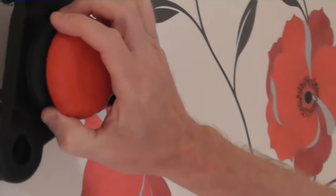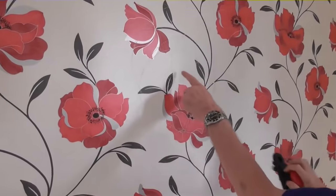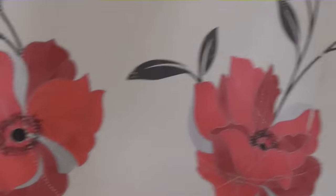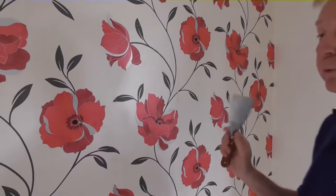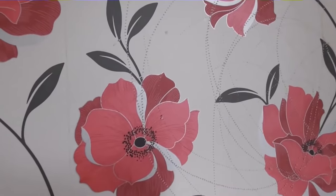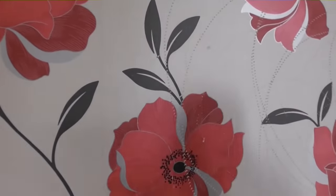What you do is put it on the wall and go round in a circular motion. As you can see, it makes all these tiny little holes in the wall to allow the water to get through to soften the paste. However, if you haven't got one of these, there is an alternative method which we used to use before those were invented - get a scraper and drag it across the wall at an angle, one way and then the other in a crosshatch fashion, to allow the water to get in behind. So there is an alternative method.